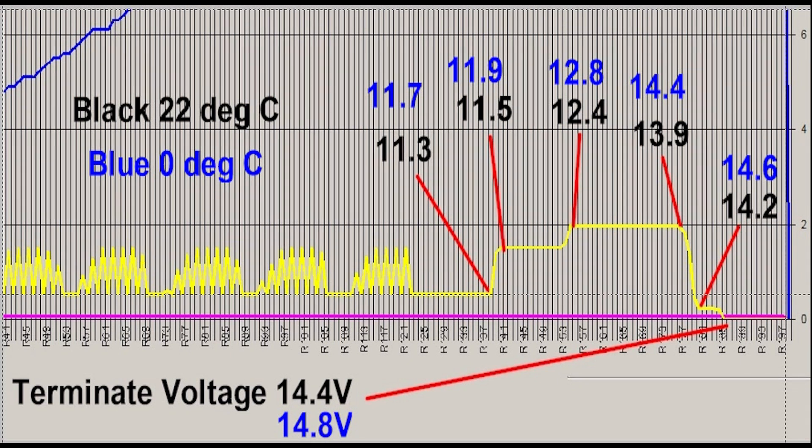If you want to hang on behind this section, you can see the full test, because the profile is slightly different — you've got a longer tail on here. Here I've just taken the normal 22 degrees 12-volt lead-acid test with all these figures in black, these inflection points here, and then I've done the test with the charger in a glass of water. You can see for yourself that it does charge at a higher voltage and it terminates at 0.4 volts higher — so we're talking about 22 degrees. 0.4 volts is roughly 20 millivolts per degree Celsius, so it's a negative temperature coefficient.